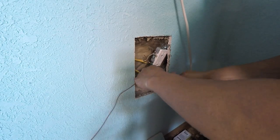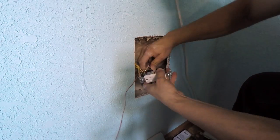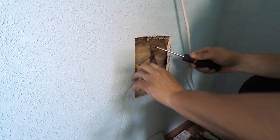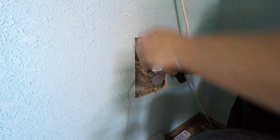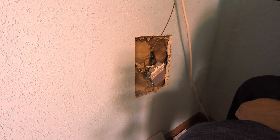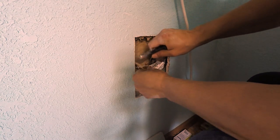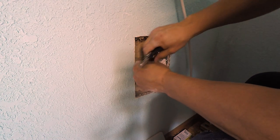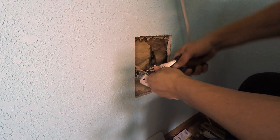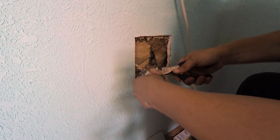Make sure the wire connecting to the bottom of the outlet has enough length to work with — you don't want it so short that you're pulling wire or pushing the outlet to reach. I left the ground wire just a little bit longer than the black and white, so I know I have enough to tie into the ground wire, then I can cut it after.